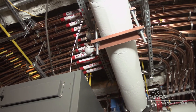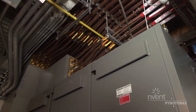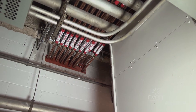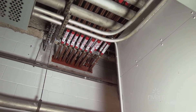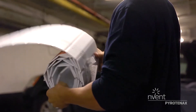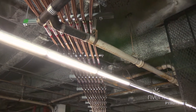One of the hardest things on this job was that we didn't have a whole lot of space for the amount of cable we needed to pull in. The benefit of having MI cable is that it takes up a lot less room than conduit and wire — it's a space saver. MI cable is also very durable, it's waterproof, and it can take a little bit of knocking around.